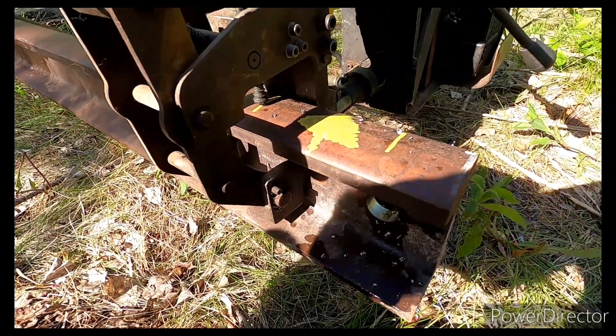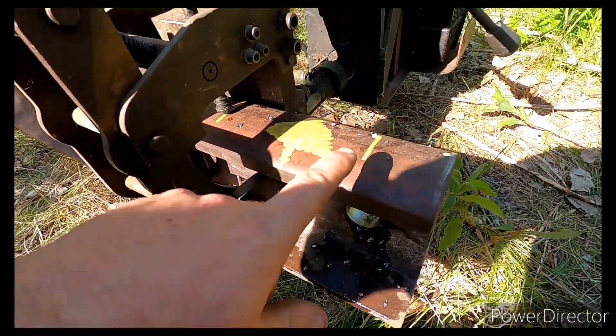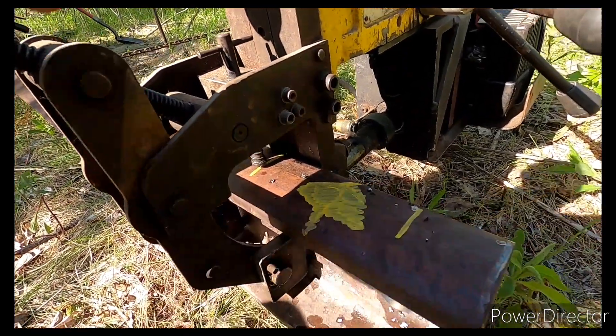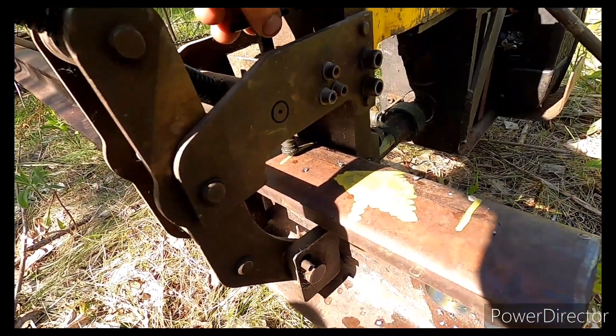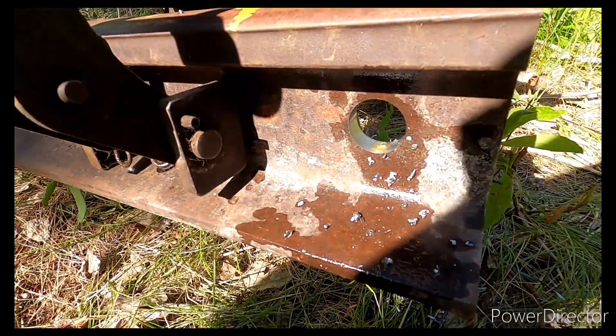Here's the setup on the rail. All of our 90-pound rail is going to be two and a half inches on center from the end and eight and a half inches on center on the end. This is just a spring-loaded plunger — you drop down on the line and that's how it drills the hole on center on the web.